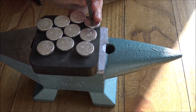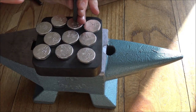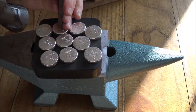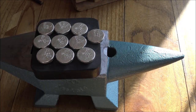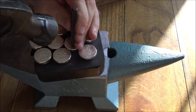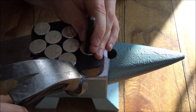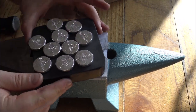I've put a black rubber block underneath and that's to protect and preserve the patterns, ripples, and stamps on the other side. If I were to stamp them upside down onto the hard steel, it would completely warp and damage and flatten out any details — which is not good. This hard rubber block does that really well. But because they're a rounded surface, it can be very difficult to get the right purchase on them, especially at the edge of the round. You can see some of them leaning over to one side when getting those stamped — it is a little bit of a labour of love. Having done 4,800-plus individual stamps on this whole collection of 200-plus rounds, it certainly did take its toll.